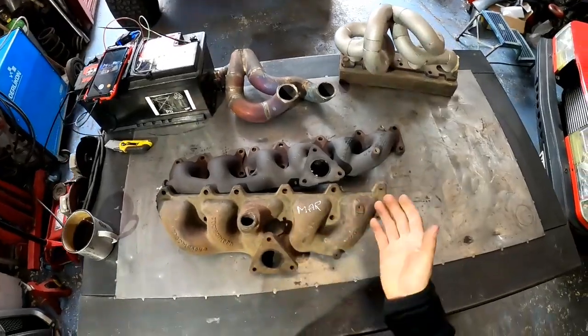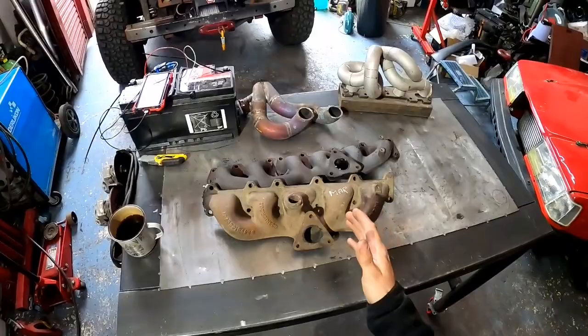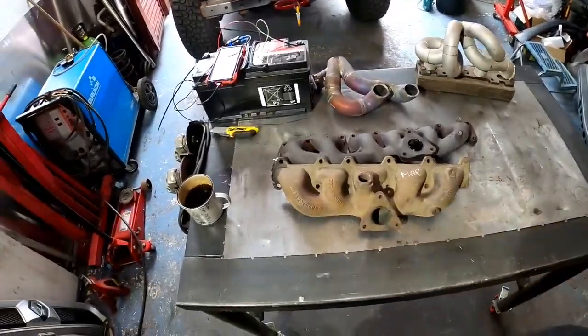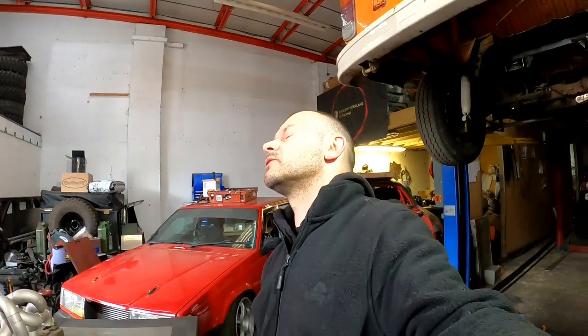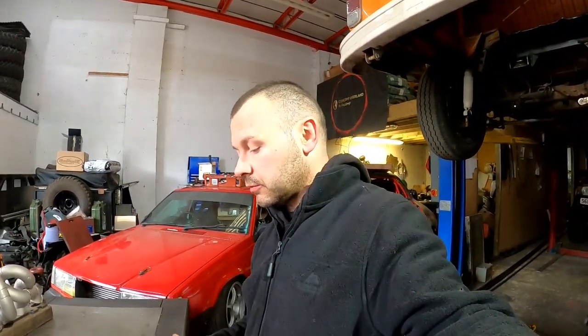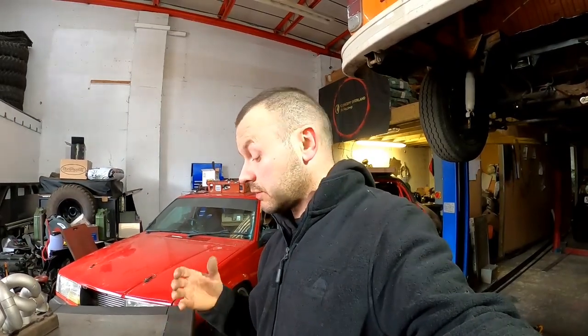But the biggest problem with exhaust manifolds is the gas distribution, is the gas flow. Now people think in pressure. As soon as it holds the pressure, it makes 1000 brake horsepower, no problems. It has been proved that the Cummins on the log-style manifolds make 1000 brake horsepower, no problems. Oh, you fucking dumb dickhead. It's not about the pressure, it's about the flow with the pressure, all right? So yes, you can make good power. You can make a decent power, you can make very good power on a log-style manifold, even on a shitty manifold, even on a shitty plenum.